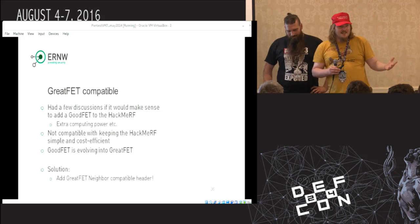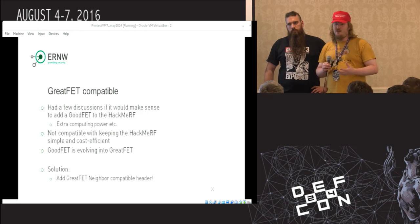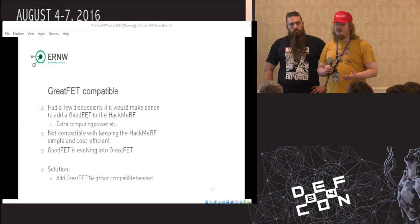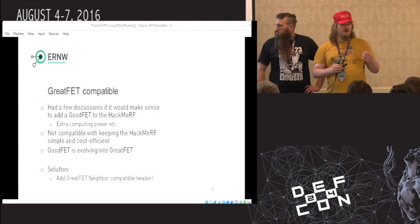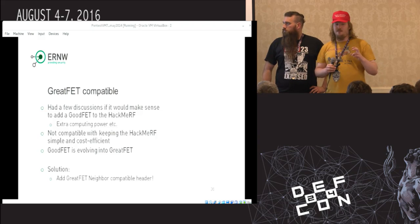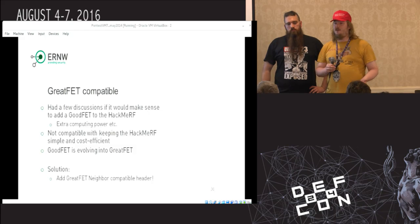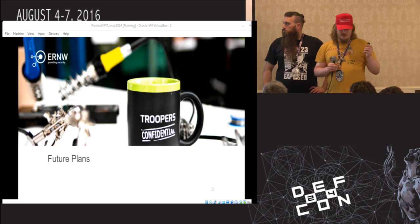For the keyboard we've got two concepts. The first one is snap dome buttons — small metal domes that you place on a PCB and press as a keyboard. The alternative we're actually aiming for are rubber membrane keyboards like in TV remotes. With a PCB underneath with the contacts, the rubber mat, and another PCB with holes in it on top — add a few screws and you've got a really nice rubber keyboard. A mold is about $700 and you'll be able to produce about 900 rubber mats with it. As we're in contact with Michael Ossmann, we initially had discussions about making the device a GoodFET, adding the MSP processor to get more power on it, but the ARM Cortex M3 should be enough for most things and adding the extra MSP would raise the price.